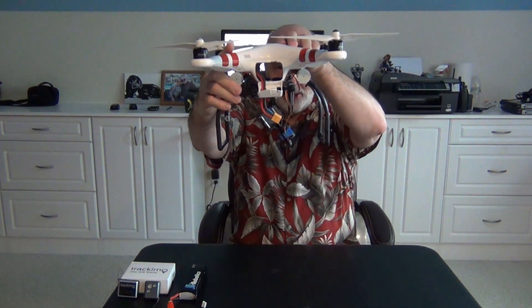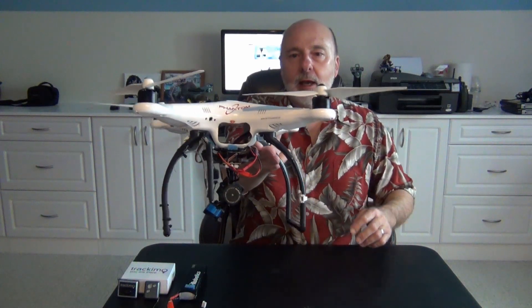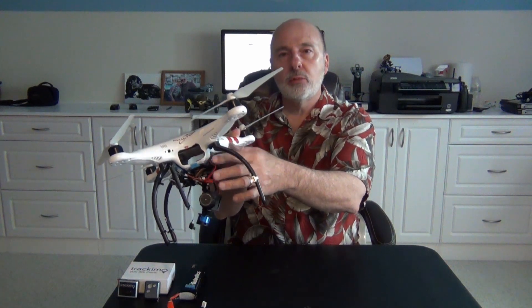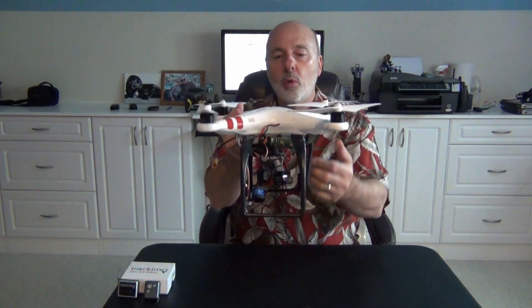What I've done here — it looks like a standard door, but if you can see all the way through, I've cut out the back end of my Phantom 1 and relocated the indicator light. It takes a little ability to tinker — you need to be able to solder and add some wires to move your extension over. But what this now accommodates is that this battery fits directly in there. Everything connects to the outside and sticks out the back, which completely allows balancing. So when this takes off, it goes straight up — with the gimbal, without the gimbal — it works great.